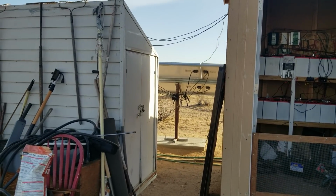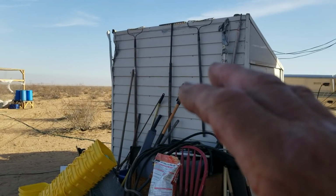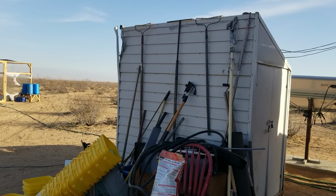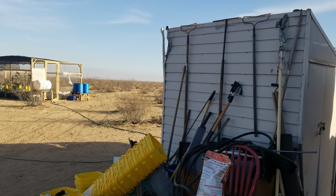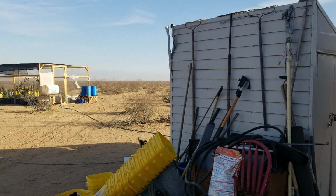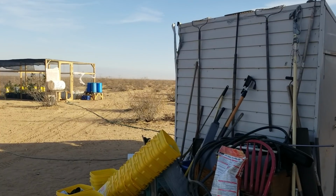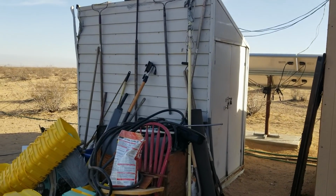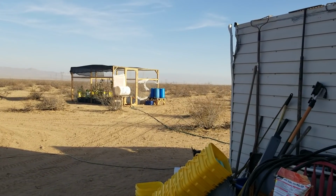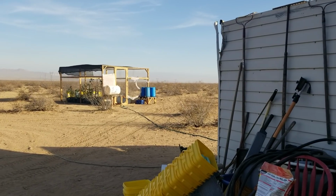If you're going to be 100 feet away, then you want to probably use a 3-phase AC turbine. The reason for that is you can use smaller wire. You could probably run 12 or 10 gauge wire for that turbine all the way over and not get any voltage drop. If you had to do that with a DC turbine, you're probably going to be running number 6 wire so that you don't get voltage drop.